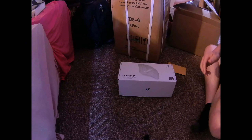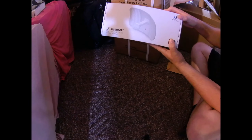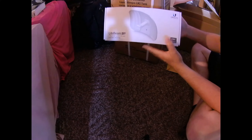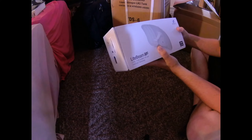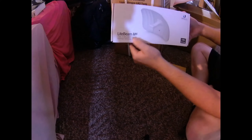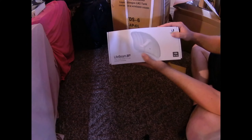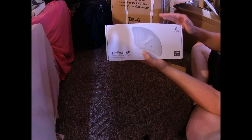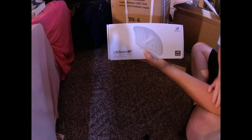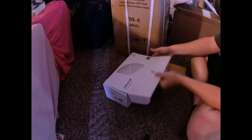Hey, it's Willie back again. A couple weeks ago you watched me do a point-to-point install using the Ubiquiti LiteBeam M5, and I mentioned how easy it was to put this together. So we're going to do a quick video to show you how to assemble it — we'll unbox it, take a look. It says CPE, customer premise equipment, but you can do point-to-point with these. For $49 a side, if you don't need AC and can work in five gigahertz and need about 100 megabits, this thing is really the way to go.